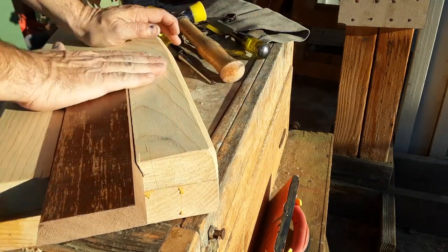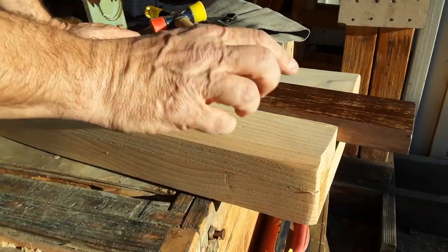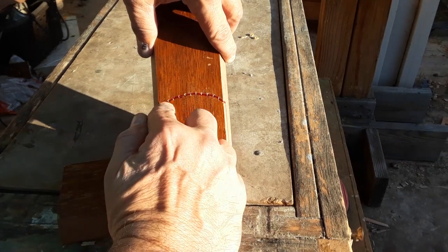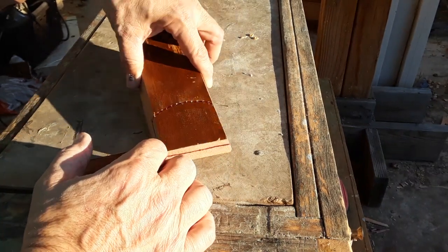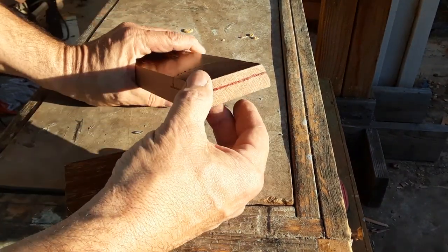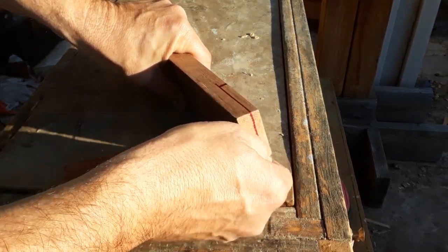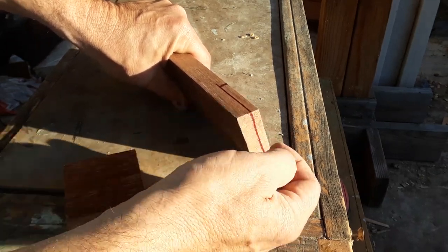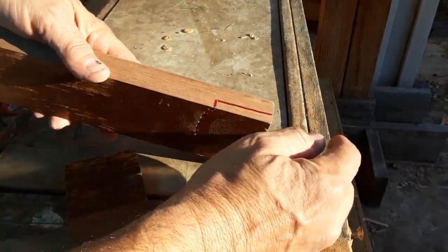So I will cut this off and then trim this down. But the next step is also to cut this out so that it can be the stay. And then I got to figure out, I took the hole saw that I used to cut the original hole. That gives me my upper limit. I just sort of hammered it in. And then I measured, by holding this up against it, the depth of the gap in the screw that this has to press up against. And so that leaves this as the amount that I have to remove.